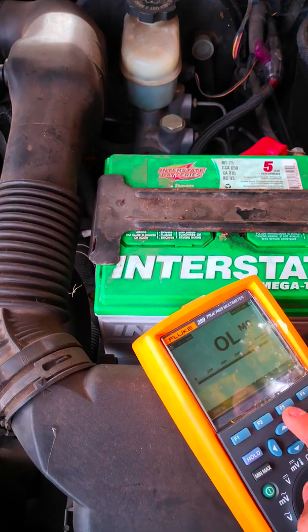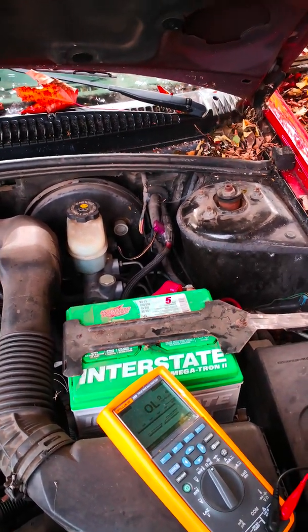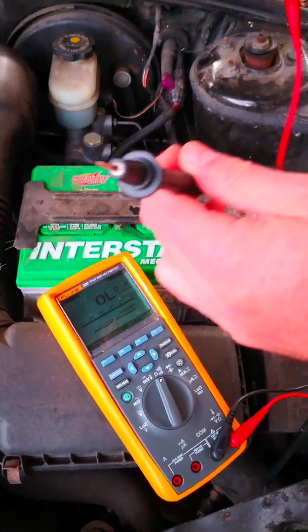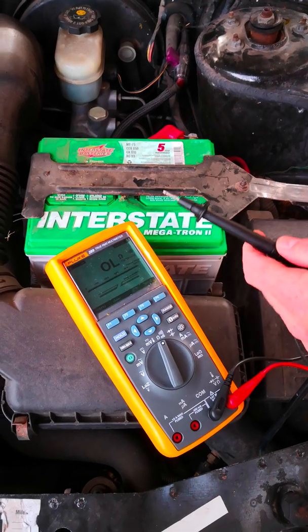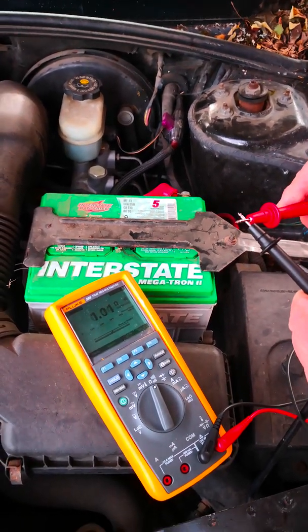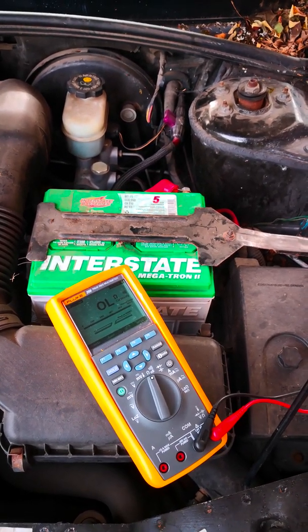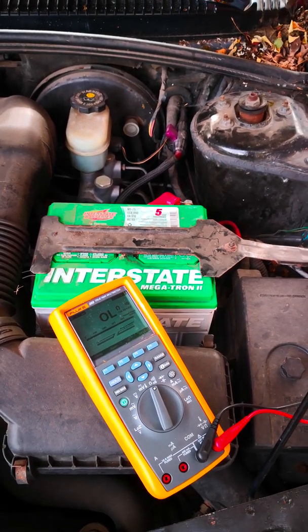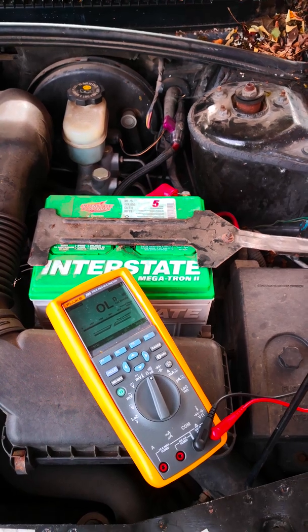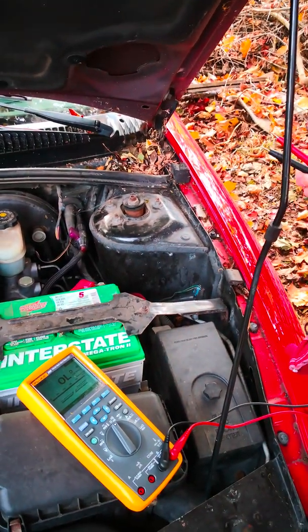The other thing that position allowed you to do was checking diodes. There we go. So now we got it to open circuit, which shows you a little picture on this one. I doubt you'll ever get a meter that does this unless you have a reason to buy a high-tech one or work with electronics like computer circuit boards. You connect it and it beeps. Okay, and that's generally under, I believe, 34 ohms. Your meter's instruction manual will tell you under what resistance it considers that continuity. That may not be good enough. Generally, it's good enough if you're working high voltage, high current stuff. If you're working some super low current, low voltage circuits, that might not be good enough. You might need less resistance than that when it's closed to actually be considered a closed circuit.